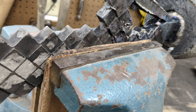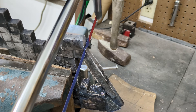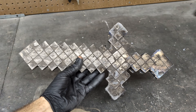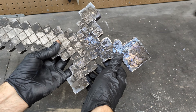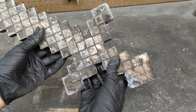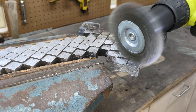All right guys, in the garage it's time to cut off all this extra aluminum from this cast. Taking a quick look at it before I pull out the grinding wheel — I do see some defects in the cast by the handle and the guard. That's because when I buried this in sand, I stopped vibrating the container once I got to the guard. You really want to vibrate the casting box very well to get that sand compacted around that foam.